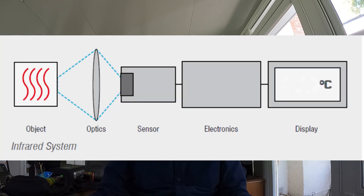Here is what an IR thermometer looks like from a functional standpoint. The effect is that you are getting a generalized temperature of the entire IR sensor field of view. You want to try and place your target area just inside the IR sensor field of view — this will yield the most accurate temperature. The thermometer will only report the aggregate temperature of all surfaces in the IR sensor field of view.